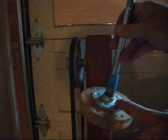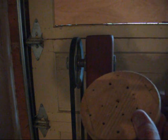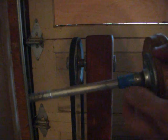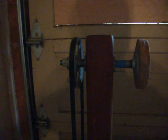When I want to mount work to it, I have a five-eighths inch bolt that goes to a flange fitting for a pipe — like a floor fitting — screwed into two pieces of wood. The grain is at right angles to each other for strength and they're glued together permanently. I can put a piece of work on the end, screw through from the back to grab the work and hold it onto this wood disc. There's another piece of pipe slipped over the bolt as a spacer with a hole drilled through with a pin. The whole thing is epoxied together so it spins as one unit.